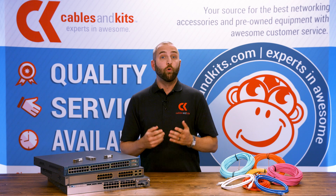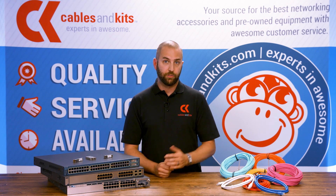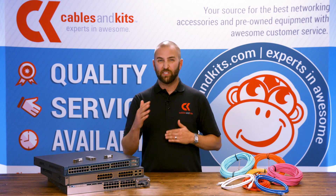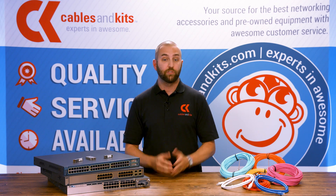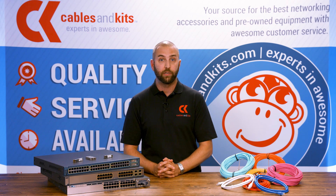So why do you need one? We have a rule of thumb here internally and a guide that we give to our customers: if you're trying to connect two devices that are over about six to seven feet apart — which would typically be outside of one cabinet — you likely need to look for a transceiver to facilitate that communication.